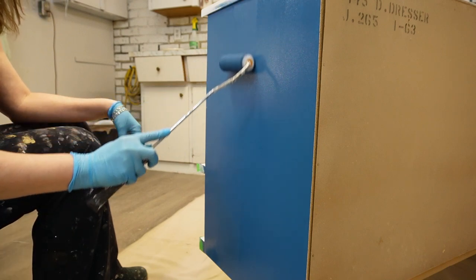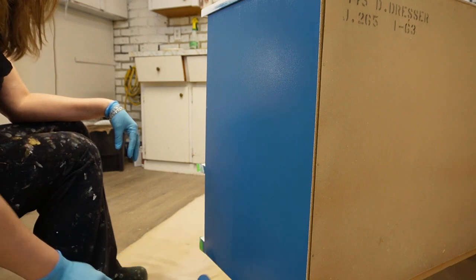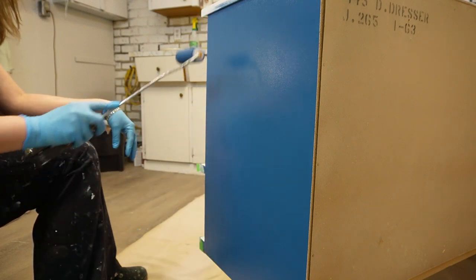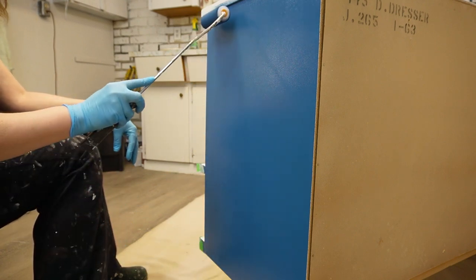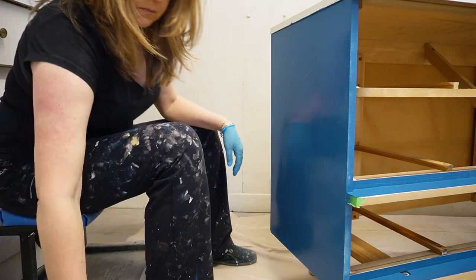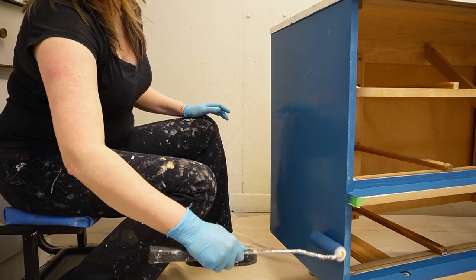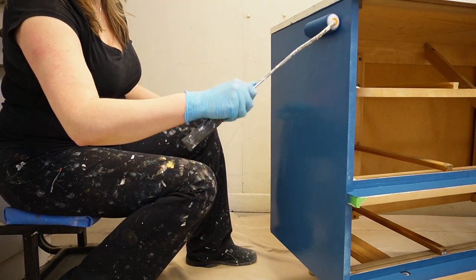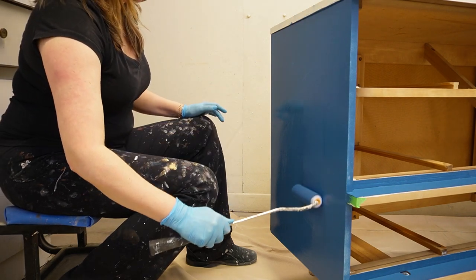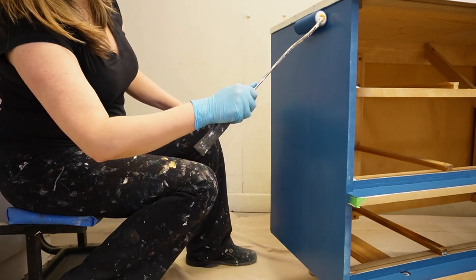You'll see there's a tiny little bit of texture in the paint, but as it dries it will actually lay more evenly — wait till you see what this finish looks like dry. The reason you don't just load the roller with paint and use a roller on its own is because once that roller is fully loaded, you're going to end up with more air bubbles in the application and more orange peel finish, giving you a lot more texture than doing it this way with a drier roller. My first pass rolling to get rid of the brush strokes, I'm putting a fair amount of pressure on it. But if you notice any marks from the roller, just go over it very lightly one more time.